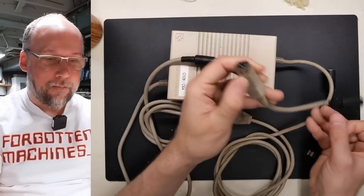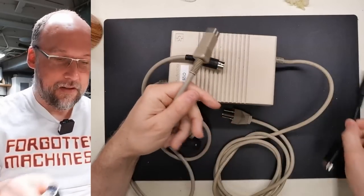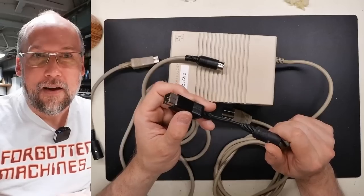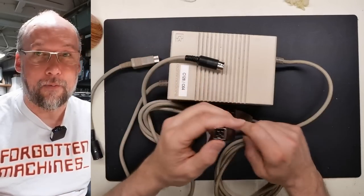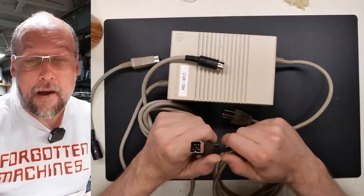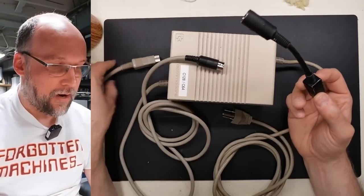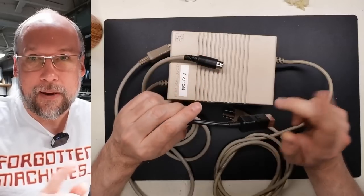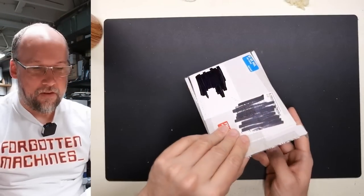In my little box of cables is the original pigtail I made, and this is the one Brett sent in — so it's useful to have two, since I occasionally misplace it. I also have a homebrew power supply I use for powering up 64s and 128s — inside it is a 3 or 4 amp 5V supply along with a 1-amp 9V AC supply. I'll stick this adapter right on top of the power supply so whenever I need to work on a 128, I don't have to go looking for it.